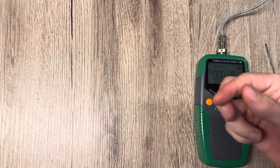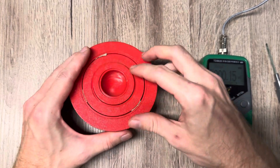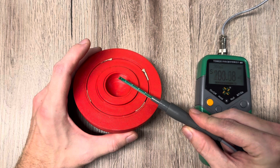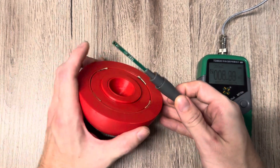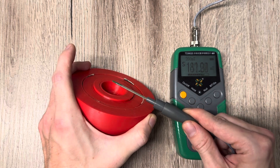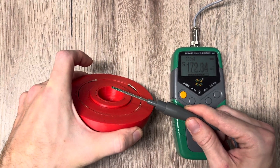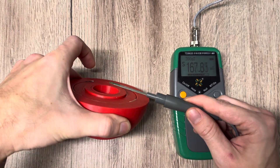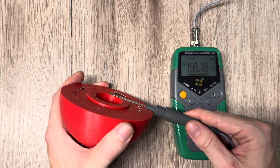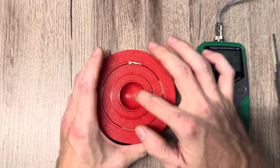This is what I mean — if we take again these three arrays, you will see all of the magnets are facing right to this center point, which is why we get such a strong field amplification. I'll take the probe and show you how strong the field is at a distance. The gap from magnet to probe here is still a few centimeters already, and the field strength is still around 200 milli tesla at a distance of a few centimeters. It's absolutely fascinating how strong the field gets around here.